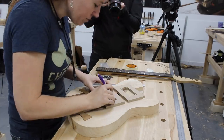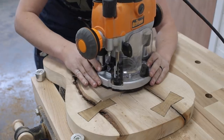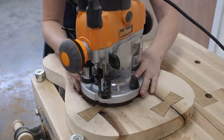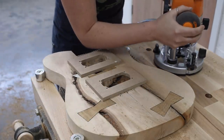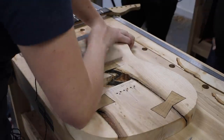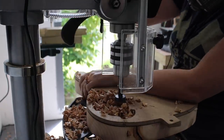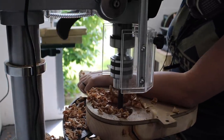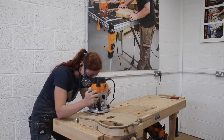Next was to cut in the cavities for the two pickups. These have a specific placement, but since their location was indicated on the template I used in the first step, I was able to place them so that they straddled that one bow tie. If you're interested in guitar making, Crimson has tons of templates and tools like these to make your job easier. I hogged away the majority of the wood with a Forstner bit, then finished it off with a router, repeating the process with the body template as well.